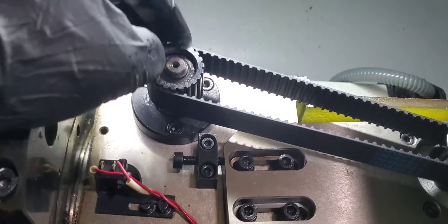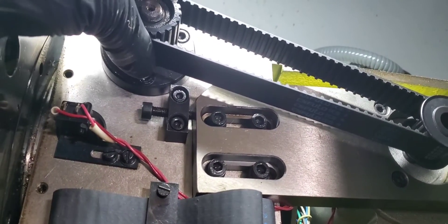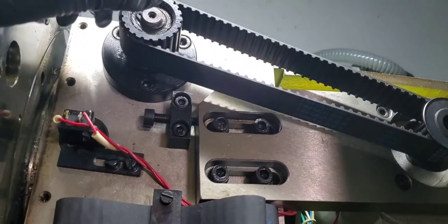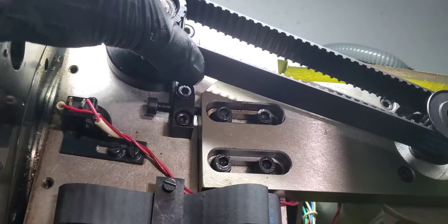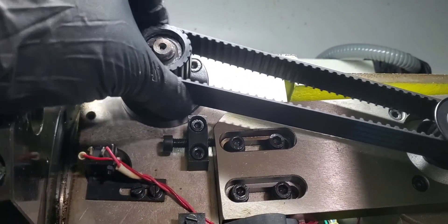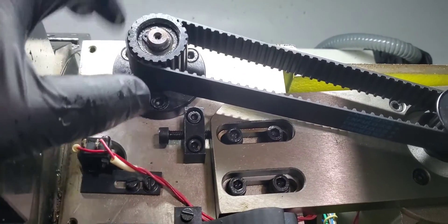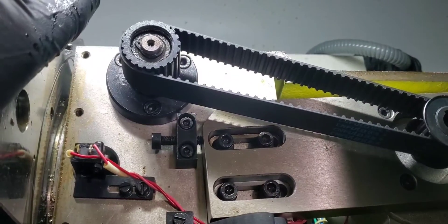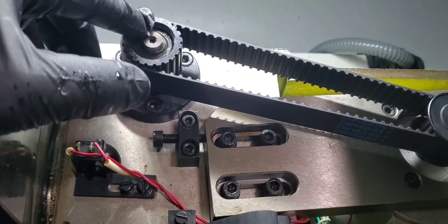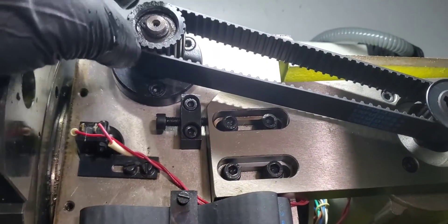Of course now that I've got it on video it's not going to behave. Sometimes if it's up against the stop it'll just sit there and buzz and won't actually move the turret. It needs some kind of running start. Basically it was just sitting there humming and timing out — almost every time when it changed directions to come and lock the turret in place.